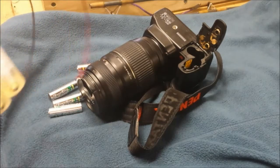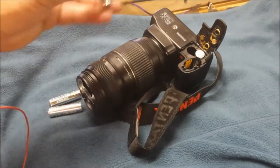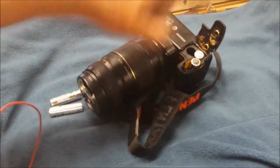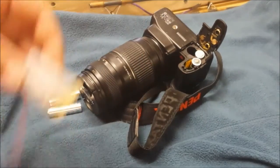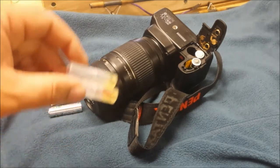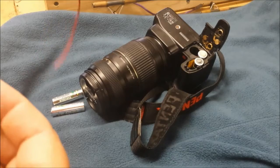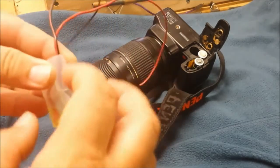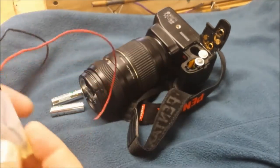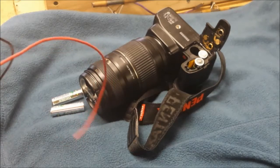Next, make sure you double-check how your batteries go in. This one will be your positive side because the positive end is down — that's where the contacts will make. I got all this from the picture of the real one you buy. The negative is on the other side. I'm going to mark which is negative so I don't get lost, then drill a hole wherever this little outlet is so I can run the two wires outside — nice and clean when I close the lid.